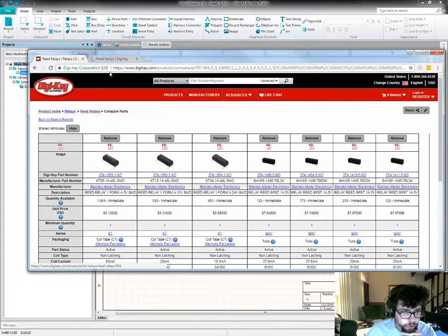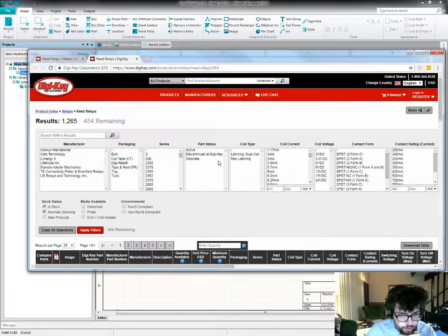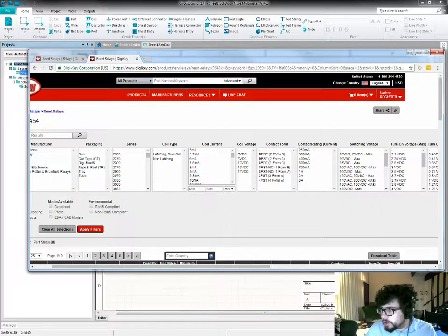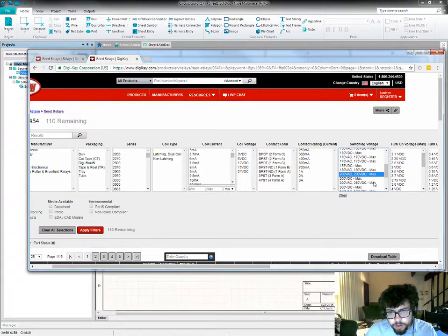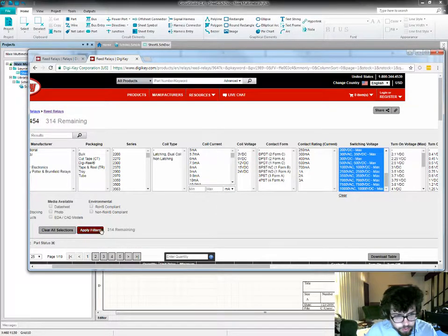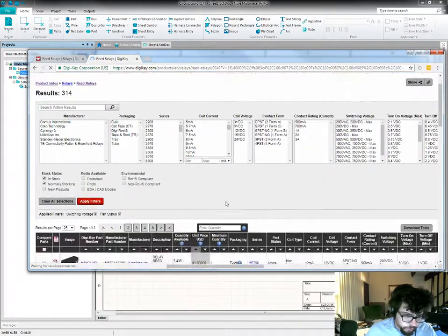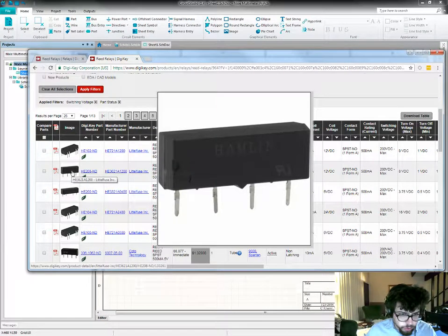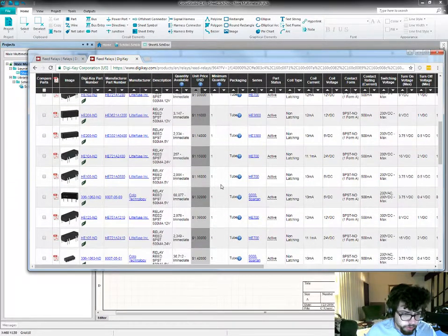I think I want to do a second search for a lower voltage relay, and use that before I pick my actuating voltage. I think I'd said the remaining positions are more in the 200 volt range. If I'm really lucky, I can find similar relays with the same footprint and not need to change footprints too much as I change relays. It'll also make the layout a little bit easier.